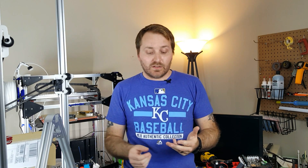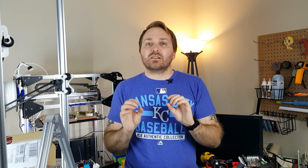You should now have a fully operational part fan that you can turn on, off, and adjust as needed to improve print quality. This is primarily for PLA, but it can also be used with wood fill — which is a form of PLA. It can be used with ABS but very cautiously, as ABS likes to warp, especially with airflow. A fan at around 25% on very intricate ABS areas is good, but I wouldn't run it much higher or you'll risk warping.